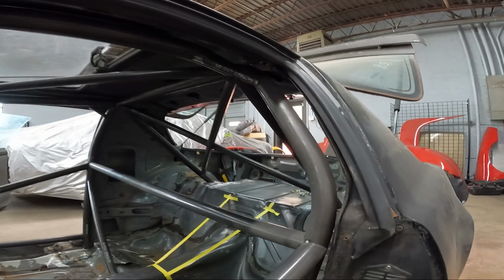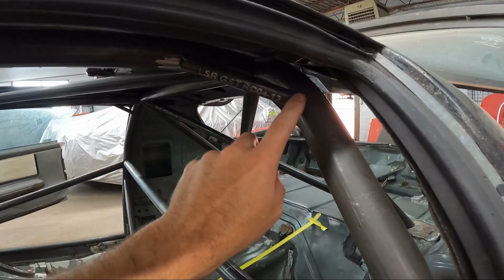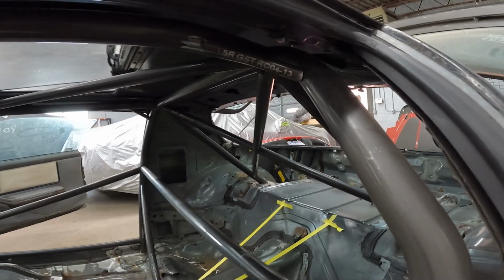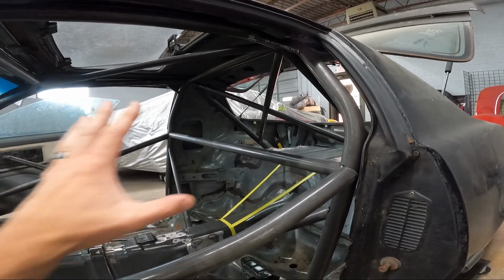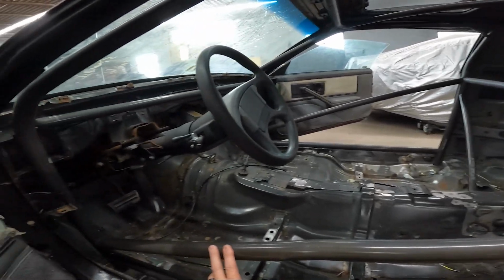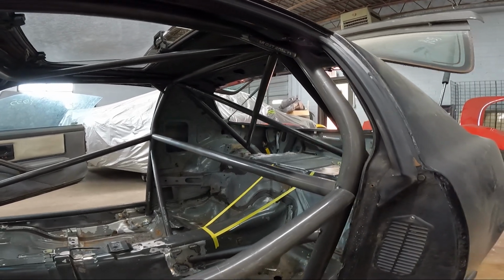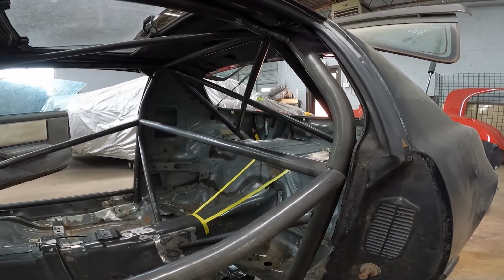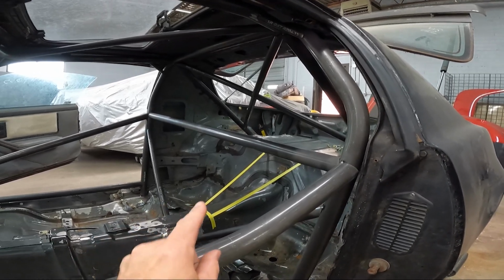So per SFI, if you include a 3/4 gusset 4 inches long in that corner where that roof joint is, you're only required to weld 75% around the tube, as long as you have that gusset in place, because that completes the strength as far as that joint, as far as SFI is concerned. So just a helpful hint whenever you guys are laying cages out or installing them. If you can't get it fully welded on top, don't panic, put the gusset in, you're good to go. If the cage inspector argues with you, buy the book for $46 and show them where it says it.